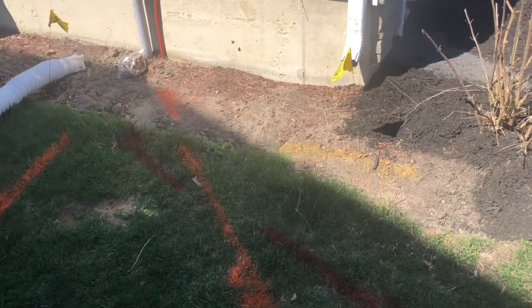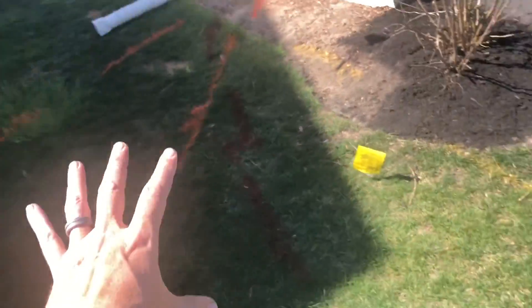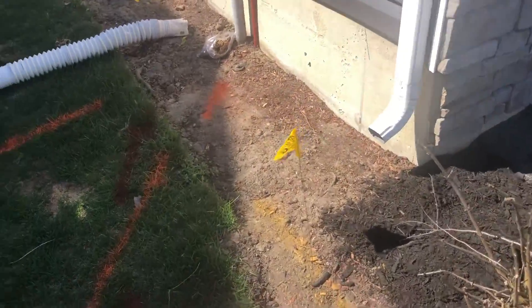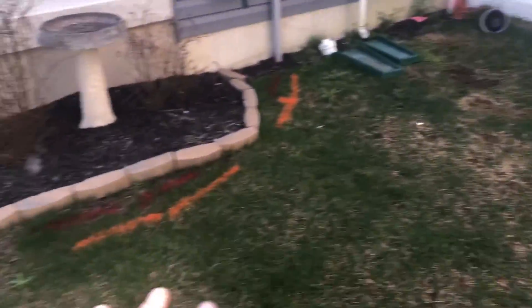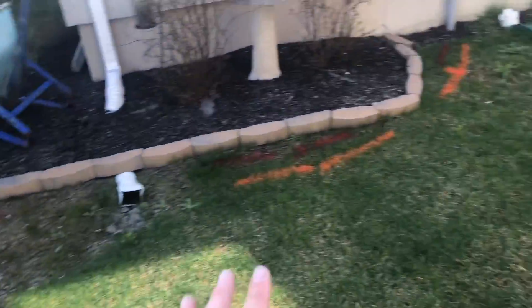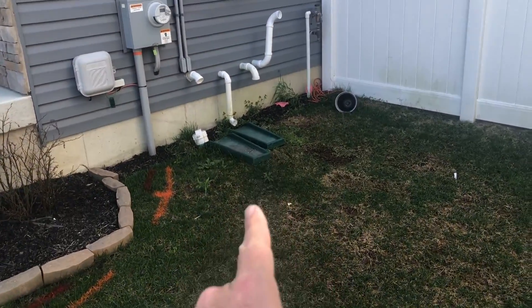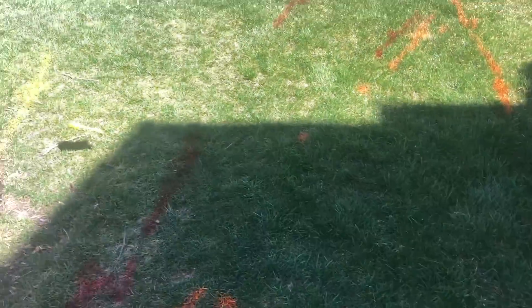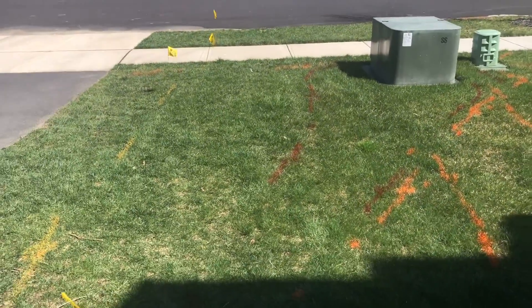As you can see here on my house, I'm eventually going to be putting pavers along this whole side all the way down to the sidewalk. So you want to make sure that this downspout's not trapped in here. Over here we have my neighbor's — he's got his sump pump and his downspout. After I have pavers come here, all this would be trapped sitting in here slowly trying to go down, and nobody likes that. We do not want mosquitoes breeding within our yard, so I'm going to be tying his sump pump into his downspout, teeing them across, having everything go straight out this way because there's too much electrical boxes and everything over there. So let's get started.